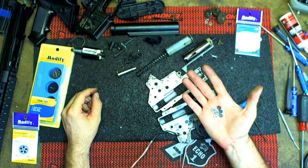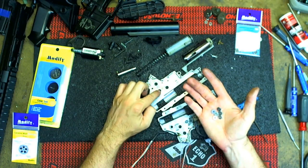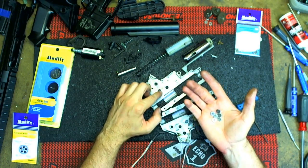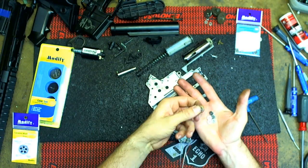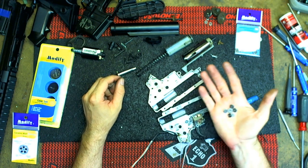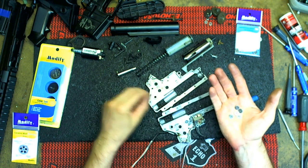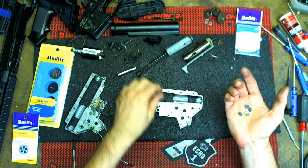To install these, I'm basically going to press them in with my fingers by hand. Some bearings or bushings are kind of difficult to press in, so you want to be gentle with them. You want to press evenly. If you hit them like with a center punch, you will break them. So just be careful with these — it's always a good idea to just try one first.